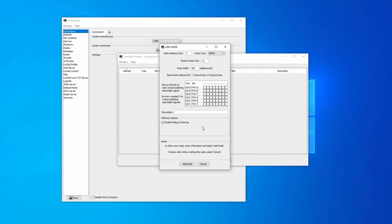And that's to do with how RS485 works as well, the half duplex, where the master, which in this case is JMRI, needs to give all of the slaves permission to send sensor updates, and that's what the polling mechanism is. When we're not on RS485, we don't need to have polling. It could be argued that polling is a little bit wasteful of resources now, because we don't need to give anything permission. Anything can talk when it wants to talk.